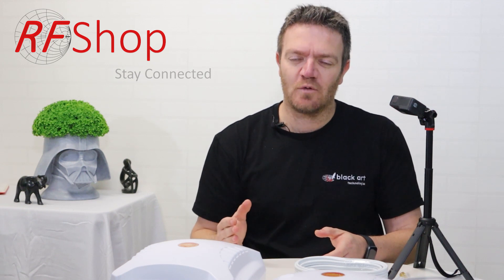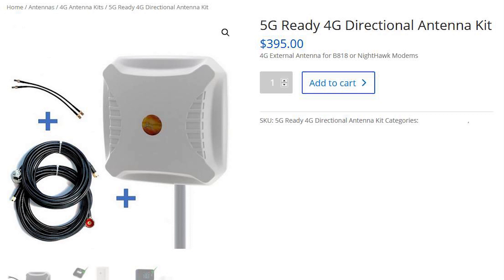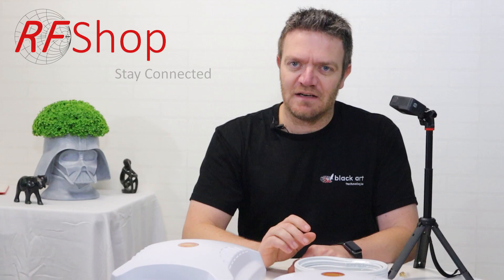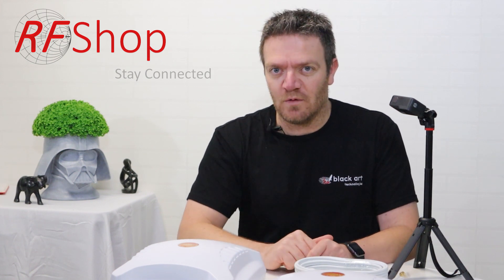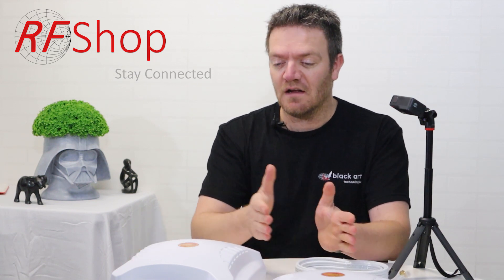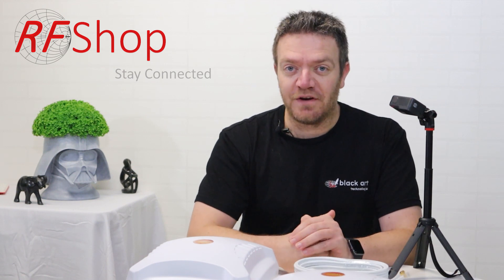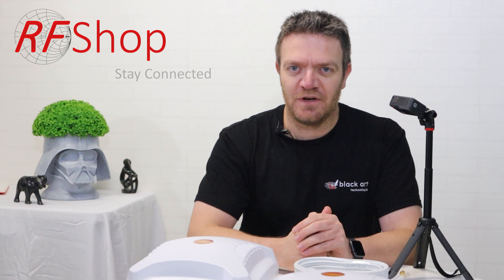The core message of this video: cable length is an issue — keep it as short as possible, and choose a thicker cable where you can. Our kits on the website use 240 cable by default, as I felt 195 over 10 meters isn't ideal for customers. You can buy the antenna standalone with the cable length you need, and contact us for any customization — single antenna, sets, or project installs — managed locally here in our Adelaide workshop.